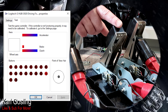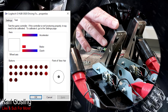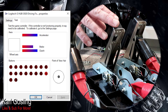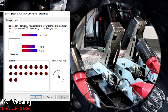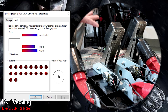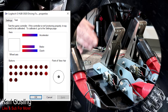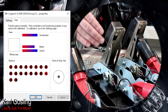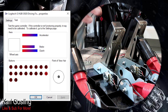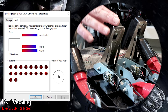It just cares about where it is in its rotation. We can bring it up to the middle — I can let go of the pedal and it stays exactly where it is. We can go down to three quarters, up to a quarter, all the way back up, any and all places in between, and the pedal just stays exactly where it is, as does the registered input on the computer and as a result in-game. You can clearly see there — potentiometers just care about position. The way they operate is that they just vary that voltage based on their position.